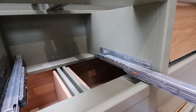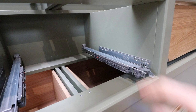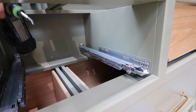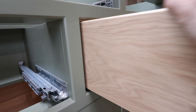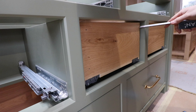If you adjust the side-to-side movement of the drawer box to get the gap right, it will also affect how one side of the drawer sits in terms of depth, because you're adjusting the angle at which the drawer sits within the carcass. So what I tend to do is cheat the system slightly — get the drawer box so it sits perfectly flat with the face frame, even if it's slightly off-centre. Adjust the left and right movement while there's no face frame or drawer front on the box, get that gap to the frame absolutely perfect, and then that allows me to stick the drawer front on with the right tolerances so it will be perfectly parallel.